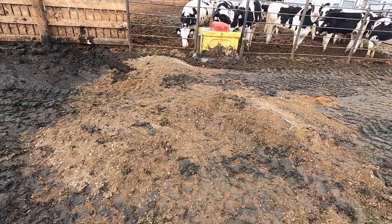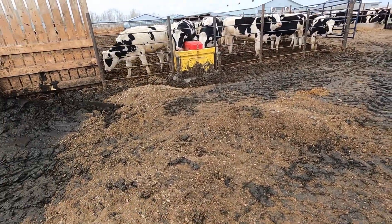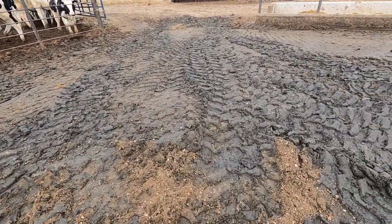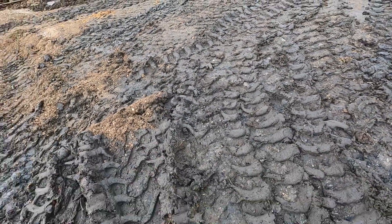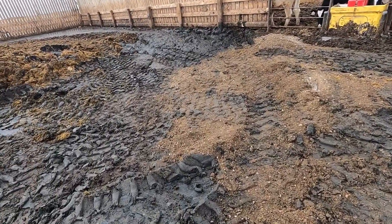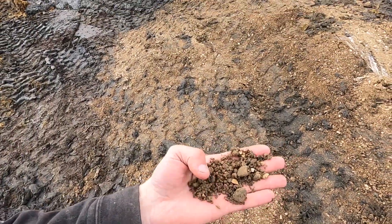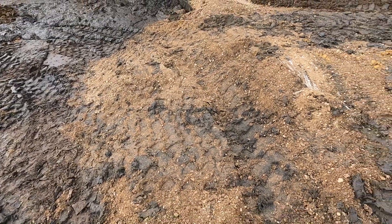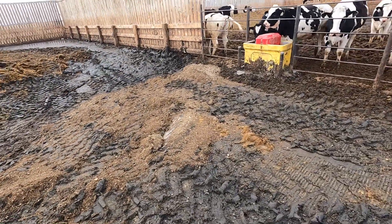Well, it's far from perfect, but that'll do. You can see it's a nice ramp — I tried to do as good a job as possible because it is going to stay there for quite a long time. Last spring we just didn't have a lot of this material. So once the stuff is in place and it gets packed down by the cows, a bit of moisture mixes into it — it's definitely there for a couple of years. This is a special mix of gravel — it's not just a bunch of stones, there's some sand, there's clay, and then you've got the kind of assorted gravel in there. So it works really good — it'll save your tires and it'll avoid chipping the concrete.